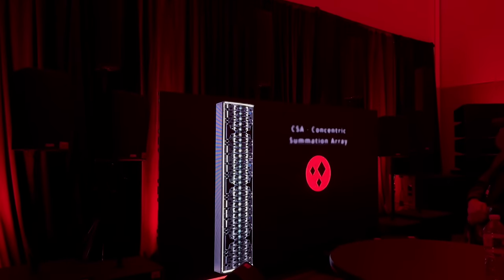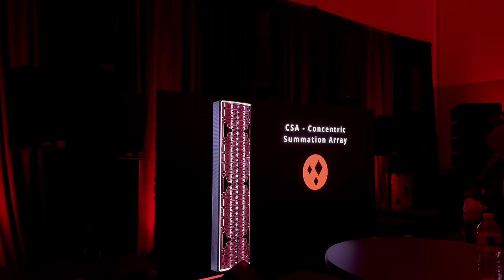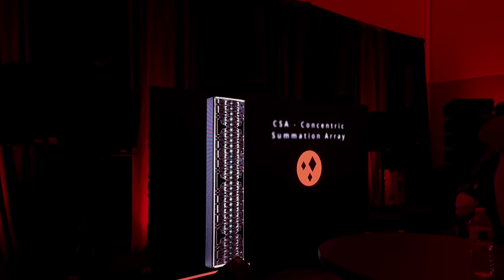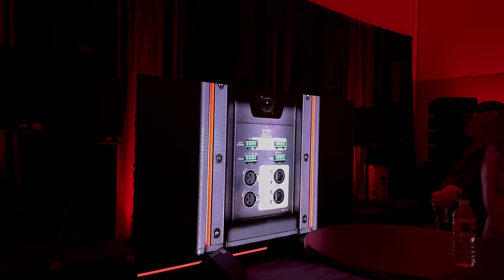The 1-inch dome tweeters are mounted to EAW's patented CSA waveguide. This approach allows both bandpasses to combine coherently in the listening area. Evenly and closely spaced transducers also enable full adaptive control from 65 Hz to 20 kHz. No other steerable column can make this claim. This is important because it enables better performance using fewer loudspeakers.